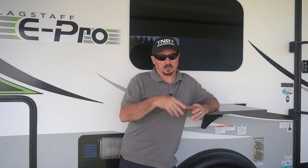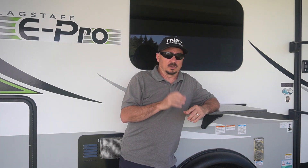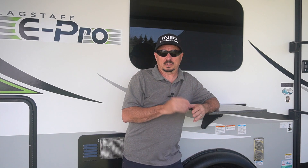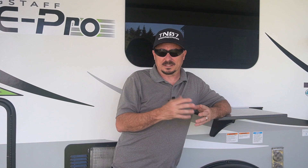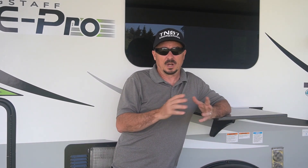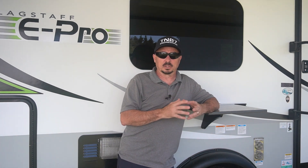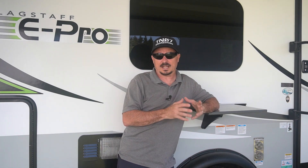So what's my opinion on the setup? It's got some pros and some cons. The 20-meter version with just the stainless steel whip, or all the way down to six meters, will work excellent. The Sporty 40 seems to be a winner. The NVIS experiment — well, I need to do some more testing to see if it's really going to perform better, because I honestly expected a better noise ratio on the 40-meter Winlink connection. Maybe we can play with the 40-meter and 80-meter NVIS on Field Day and give it a really good field test.